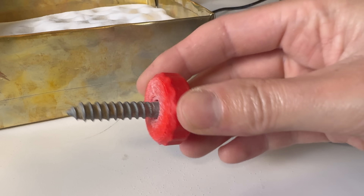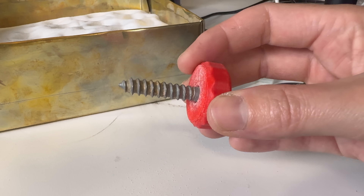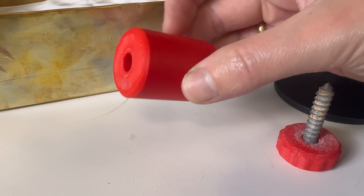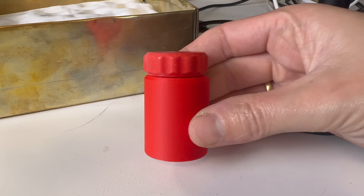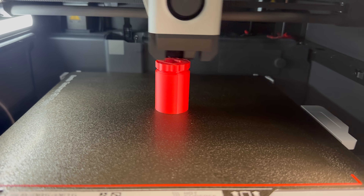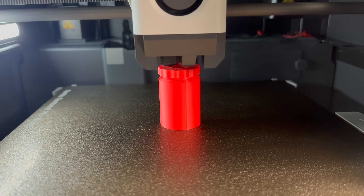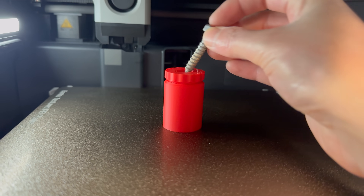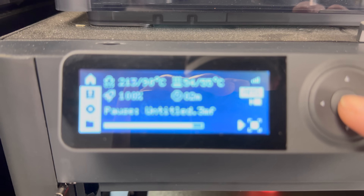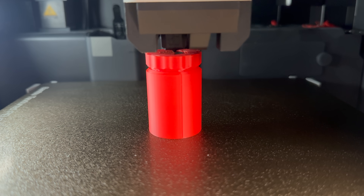For our next 1000 IQ 3D printing trick, we have a really cool way of embedding parts into a 3D print. When designing the part, we need to build a sacrificial support tower. The 3D print looks like this — we have the breakaway support tower and the screw head. The secret to embedding the part is to have the printer pause at a certain layer height, then simply take the part you want to embed, place it into the 3D print, and continue the print. The 3D printer will encapsulate the foreign object.